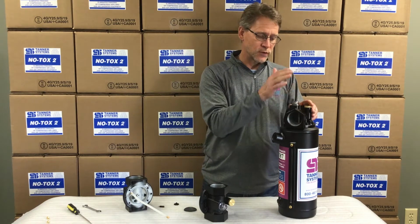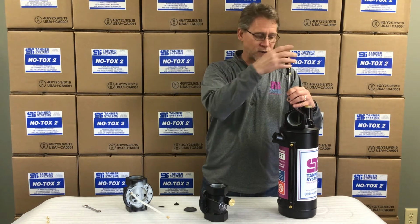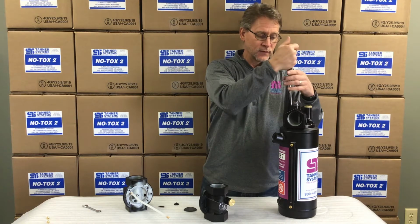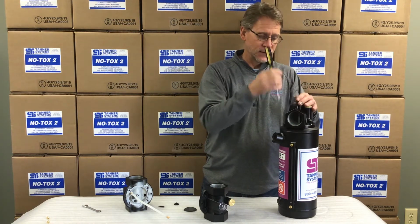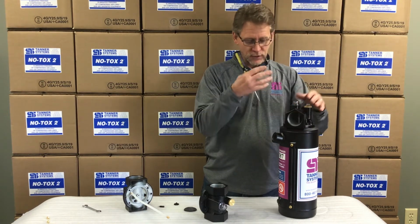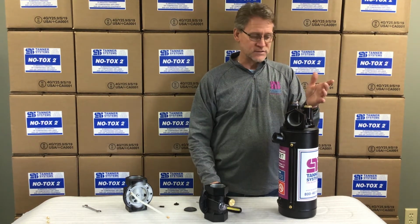The first thing would be to check our adjusting screw. Where is the adjusting screw located? For instance, did somebody close it and you weren't aware of it? Lightly put some pressure on the adjusting screw, turn it down to make sure that it's now at the bottom, and then give it a good, maybe full, two turns from the bottom to see if that opens up, if you want to say, the air loop. If you take it up a few turns from the bottom, you have air passing through the dispenser, you have fluid in the dispenser, and if you're not seeing droplets in this sight dome, then we're going to continue.